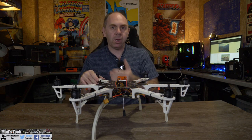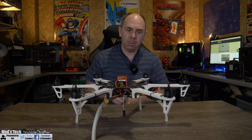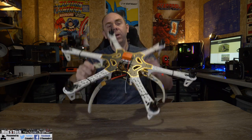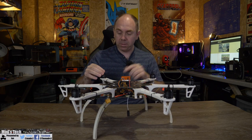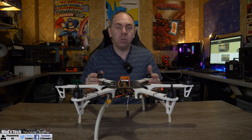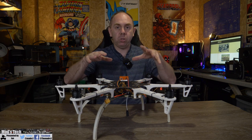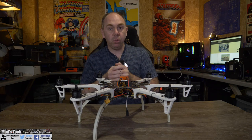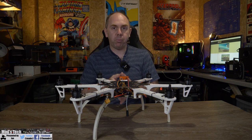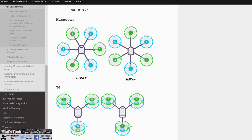When I say I've hard mounted it, I always use sticky adhesive pads to hold my gear on — that is how the autopilot is held in place. For this setup we've got the DJI 420 Lite series, the 2312 motor combination, which is pretty much the same motors used on the DJI Phantom 3 and it's a very reliable setup. When setting motors up on ArduPilot you do need to do them in a certain order, whether it be a quad or a hex.